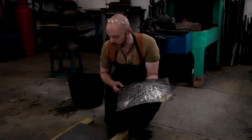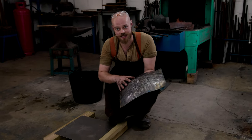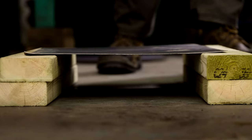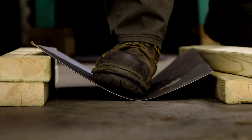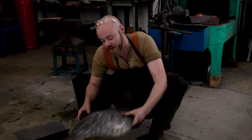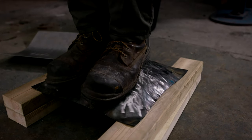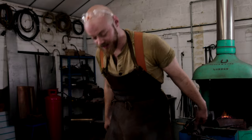One of the ways that armor gets its strength is through shape. Both of these pieces are made out of the exact same thickness of steel, but I can show you there's one stronger than the other. Here's the one with no shape — you see it buckles immediately. If I swap it for one that's been forged to have strength and shape, you can see it's much stronger. It's going nowhere.